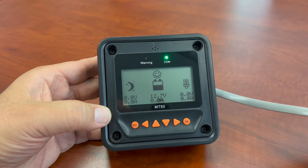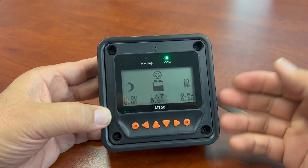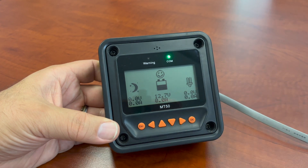Currently, when you turn them on, you plug them in using the included cable. This is an RJ45 type cable — basically the same thing you use on an Ethernet cable, just a patch cable. It will go to the unit itself and plugs into the COM port.